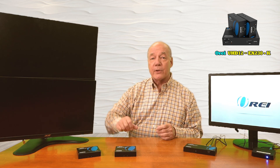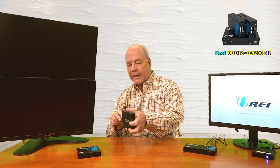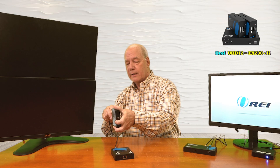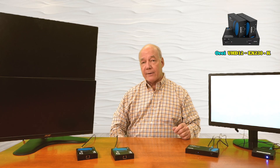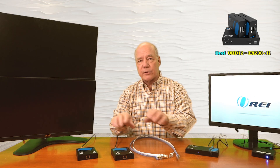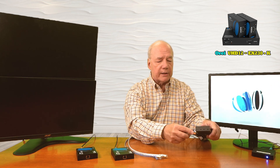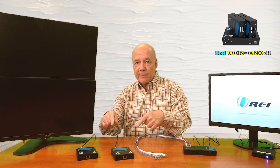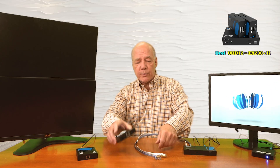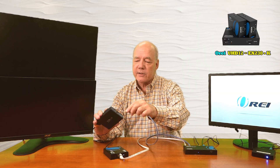Now we're ready to connect the remote receivers at those remote locations. I've already connected two high-speed HDMI cables up to the monitors, and these plug into the HDMI output ports on both of the receivers. All we're missing at this point is the LAN connection between the sender and the remote receivers — that has to be a Cat6 or Cat7 cable. I have two Cat6 cables right here. You'll notice there is no power supply required at the remote locations, because this system uses power over cable technology — once I add power to the sender module, all the power required for the remote receivers is sent over the same LAN cable along with the video and audio. Watch what happens when I plug one of these LAN cables into the receiver — you'll notice the power indicator comes on because the power is being sent over that LAN cable.